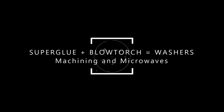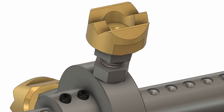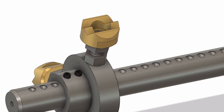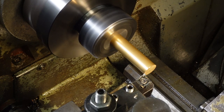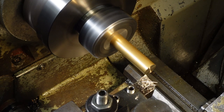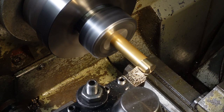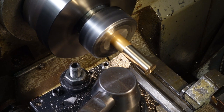It's time for another quickie. I'm using a superglue chuck to make six countersunk brass jaw retention washers for the ends of the M12 studs on my tube mandrel spider. The washers need to be a loose sliding fit in a 16mm recess in the jaws, so I'm turning them to 15.5mm OD. They're mounted with M4 countersunk screws, so I'm drilling them 4.2mm ID and using a countersink bit to form a recess deep enough to take the posidrive screw heads.